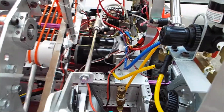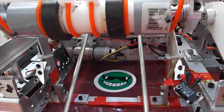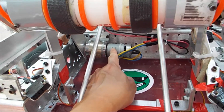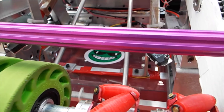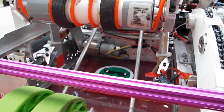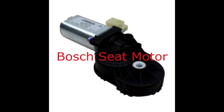Let's see what other motors we have. Down below there's a motor called a gear motor. A gear motor is really just a motor with a gearbox attached to it — it may sound like a specialized device, but it's really just a motor and a gearbox. This one is called a PG27, where 27 means it's a 27-to-1 gear reduction, which is very useful.